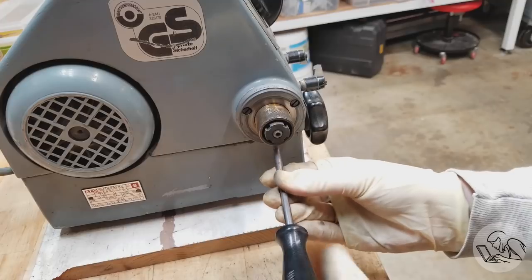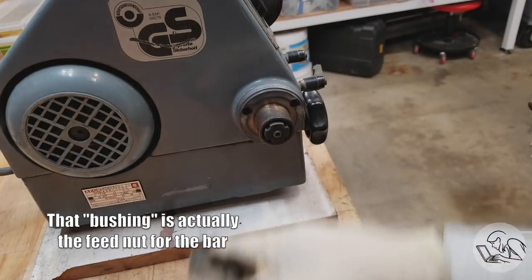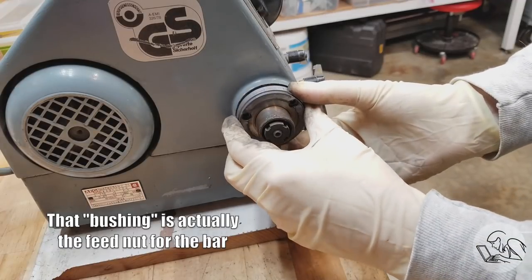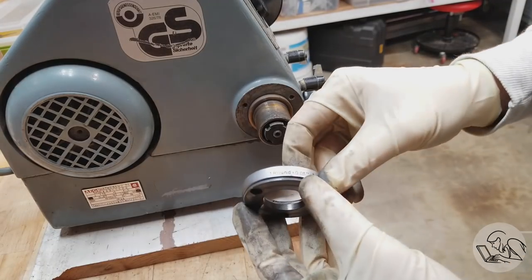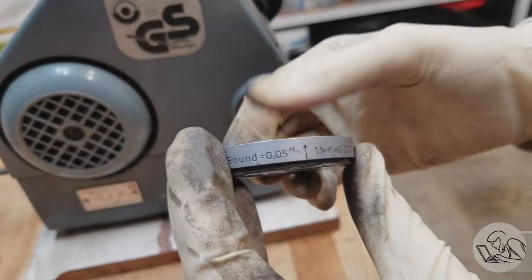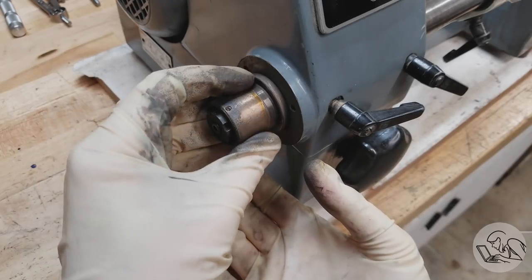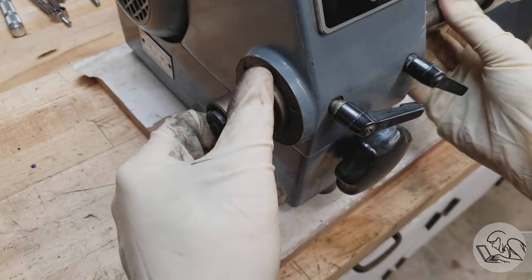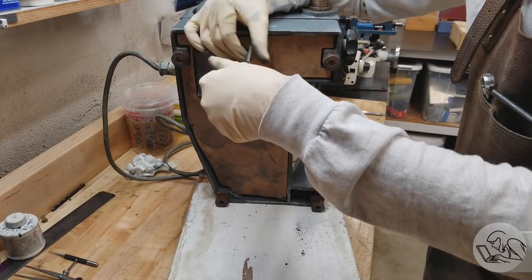The knurling is absolutely perfect. Let's try taking these screws out next. There's some kind of a bronze bushing here enclosing the rest of the assembly. Actually, it's just an outer ring that comes off — that's the markings ring for the micrometer. I guess that's a separate part so they can easily swap it out for metric or imperial. Now there's a bronze bushing that spins but doesn't come all the way out. Something is stopping it, so let's have a look underneath.